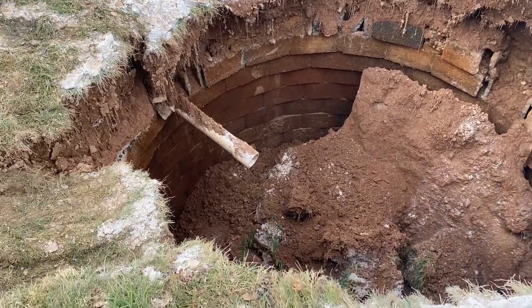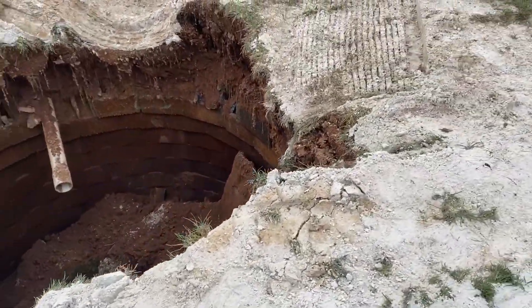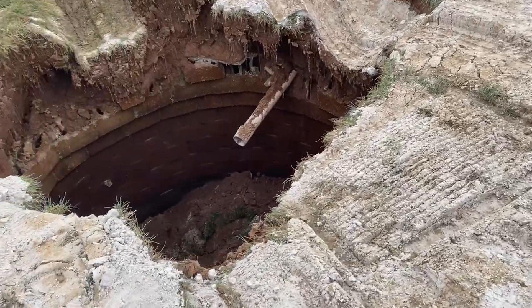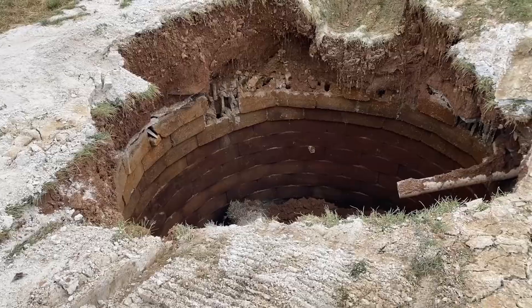A drain field is far more cost effective and safer. With dry wells, you do run the risk of — if you run something heavy over it — potentially collapsing the roof and going into it. I had a person where they were installing a pool and a crane went over their absorption system. It squished the entire lid of the dry well, and it took seven hours to get that crane out of the pit. Fortunately everybody was okay, but there are circumstances where you might not be. Nowadays when pits are used, many are required to be filled with stone. For an existing one like this there's no state requirement, but the moment you go to repair something, they're going to make you do it the right way.